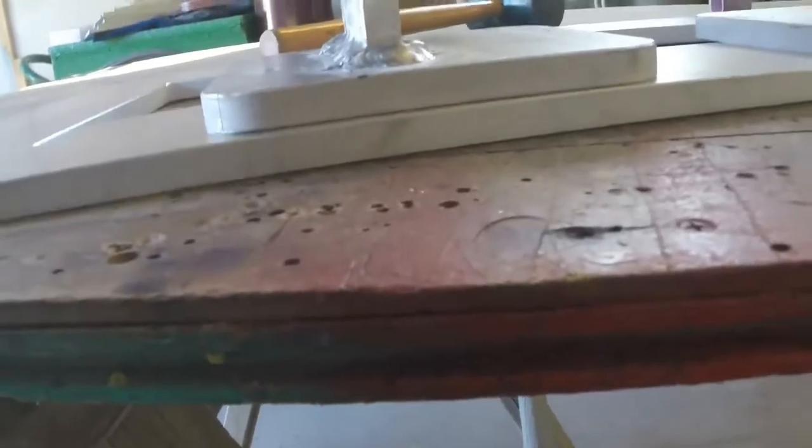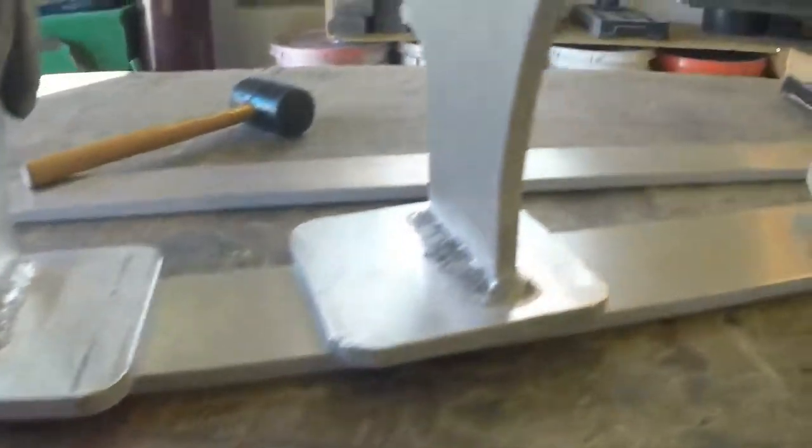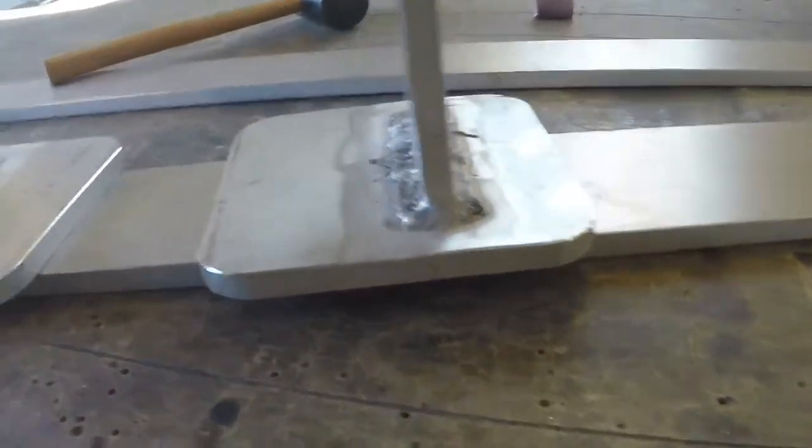That one looks really good. So, happy with that. And before I weld these on, just because it will make them harder to get to, I'm going to grind all that, make these a smooth, pretty fillet, get them clean. I'd rather not, but if I don't do it now, it's going to suck. I'll have to fight to work around the structure to get the grinder in there. So I'm just going to do it now and call it good.